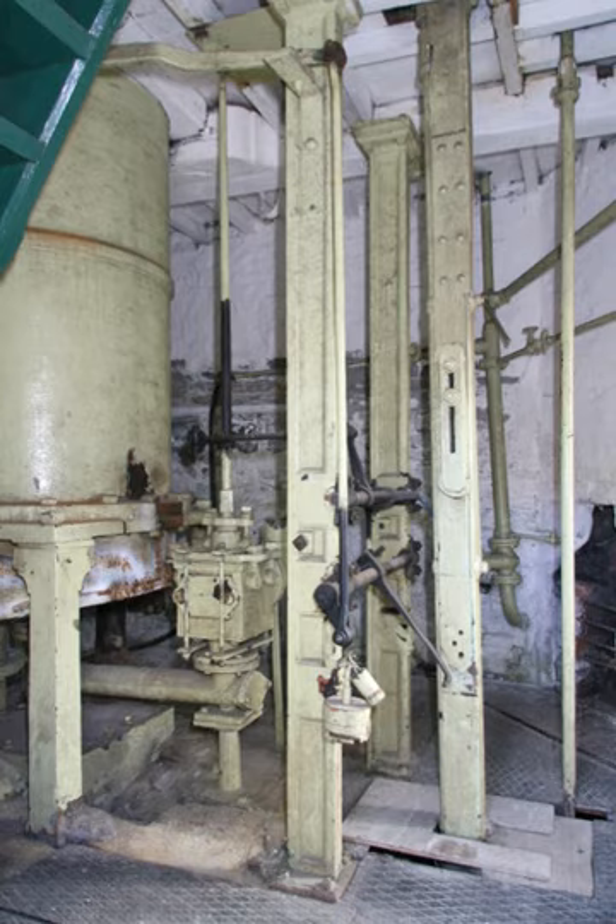The cataract, like most regulators, is an example of a servomechanism. However, unlike the better-known Watt centrifugal governor, this is an open-loop rather than closed-loop control. The cataract runs at its own speed, but does not measure the resultant speed of the engine. The cataract has also been described as a 'water clock'. This assumes that the relationship between the cataract's operation and the engine's speed is fixed, which is a valid assumption for a beam engine as the cataract controls the timing of the engine's stroke, rather than a variable power or throttle valve. Where a governor controls such a throttle valve, as for the Watt governor, the speed of the engine depends on a complex and unpredictable relation between the engine load, the valve position and the varying efficiency of the engine. Such governors must use closed-loop control if they are to maintain effective and precise regulation.